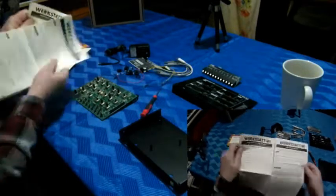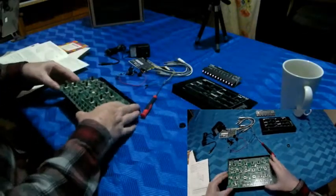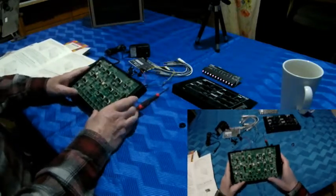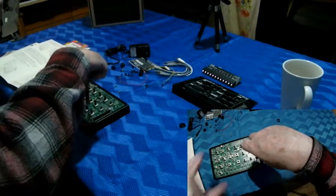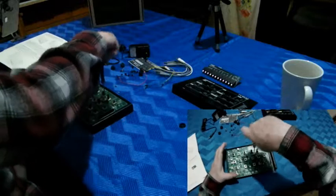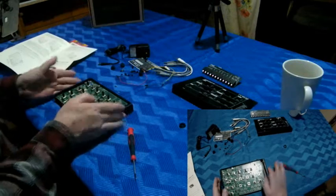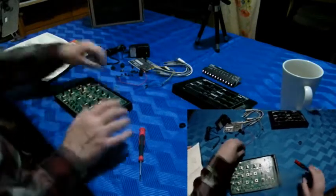Part list. Okay, at first the feet. I won't use the feet, I told you. And then put it inside here. Yeah, okay. I have the wrong glasses on here, but okay. By the way, what I have learned already is that the ground of the circuit, the common ground of these modules here, not the common ground with the rest of my machine over there, is over the case, over the metal case. And so the screws ensure that everything is nicely grounded.